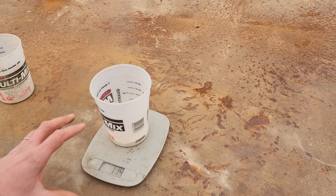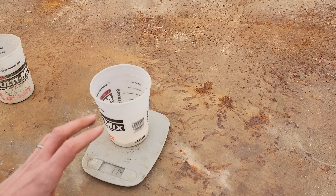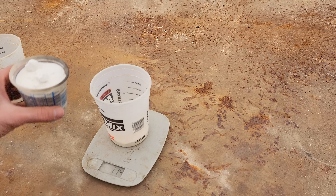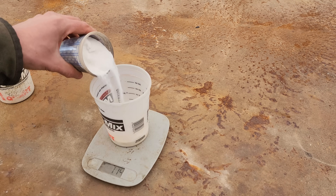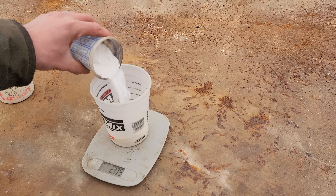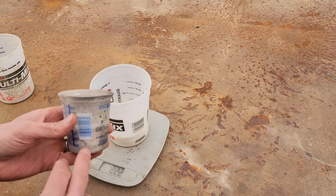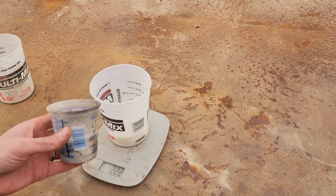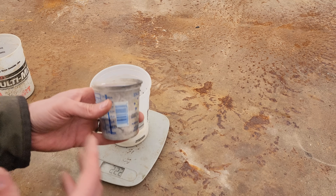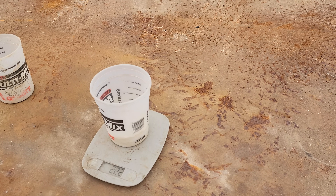The borax and the silica are really acidic flux, so they will not absorb the sulfides at all. They make it really really glassy and they're great at absorbing oxides. We're also going to add about 100 grams of soda ash. Soda ash is a very basic flux and what this does is it helps absorb the sulfides themselves. You may ask why not just use all soda ash - well, you need a huge volume of soda ash to absorb all the sulfides, especially iron sulfide.